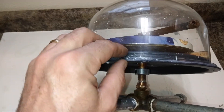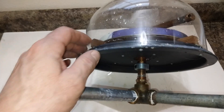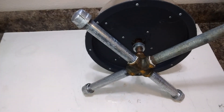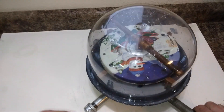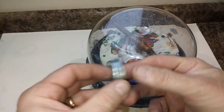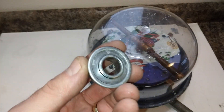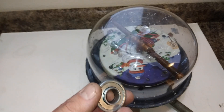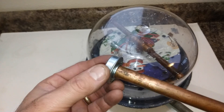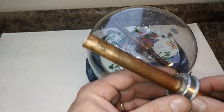If I want some real output, I'll probably build one out of steel, but this works well for demonstration and it's very inexpensive. For builds like this I like to use wheelbarrow bearings — they're very inexpensive, not precision or anything, but this one has a 5/8 inch bore, and it so happens that half-inch pipe fits right inside because the outside diameter of that pipe is 5/8.